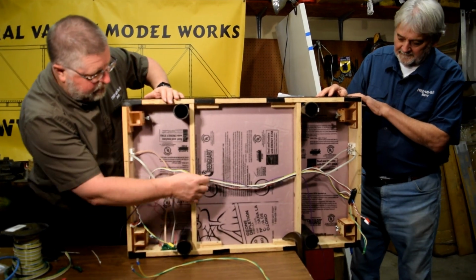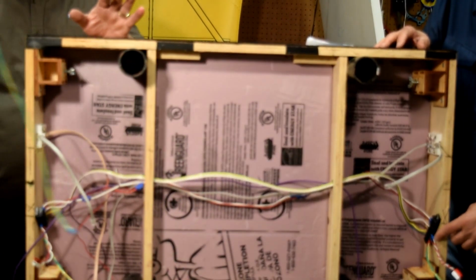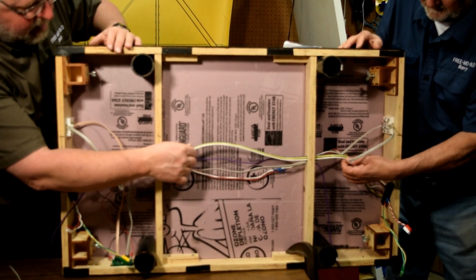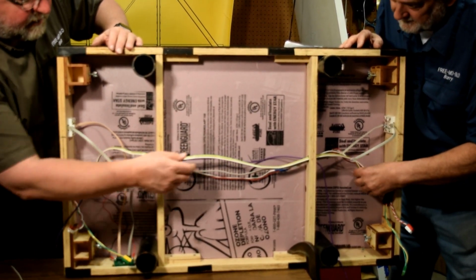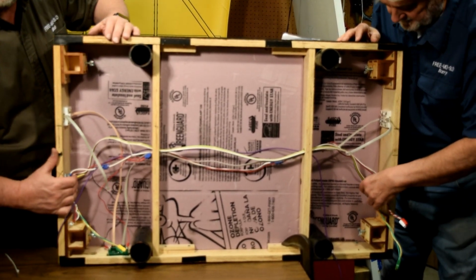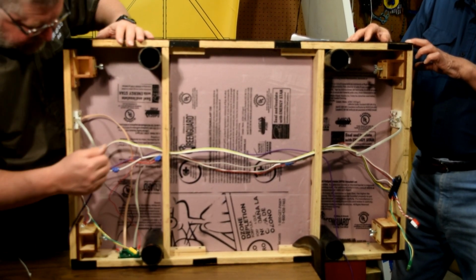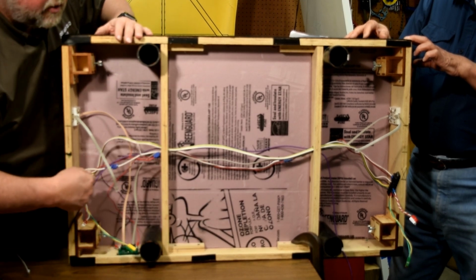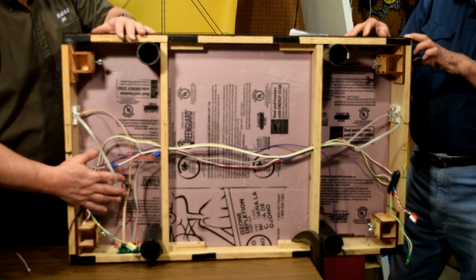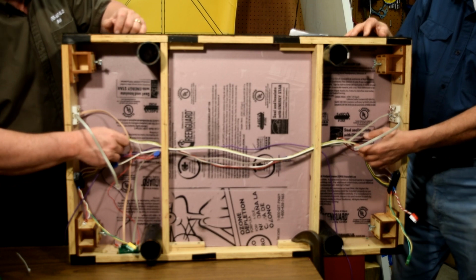We've added the new bus wire from end to end. We took out the accessory bus that was in there because we replaced it. We didn't have to; we did that just because we're using this fancy wire. One of the advantages of using wire like this, going from end to end, is we don't break it anywhere, and we do our connections off the screw terminals on this end. If we had accessories in here, we'd power them off one of the terminals on one end or the other, or both. If there was a problem on the accessory bus, we could disconnect this module and isolate it by taking those wires off, and this wire would still run the power from end to end.